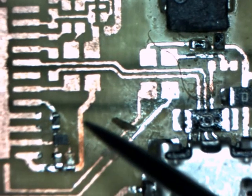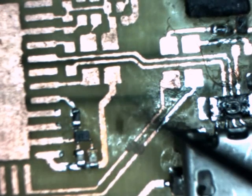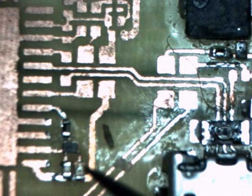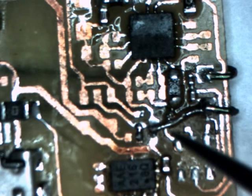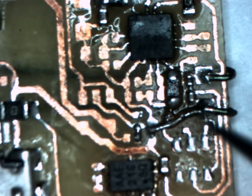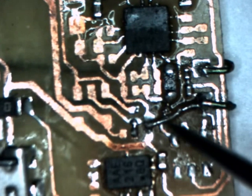And that'll be flexible, obviously, and this is slightly flexible being on such thin PVC, but it'll be a lot better. But you can see I had actually managed to solder all the difficult components, the DFN transistors, this QFN. I had everything soldered on so nicely, and then all hell broke loose here, and I don't have that resistor. But otherwise, everything looks fine.